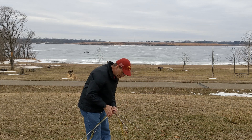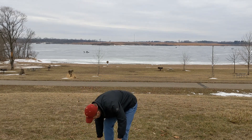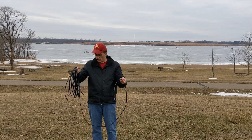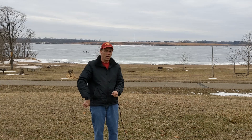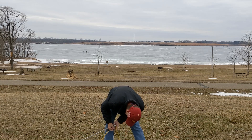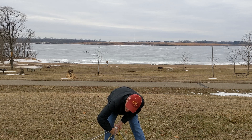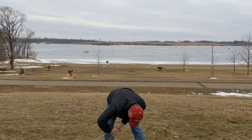Once I've got those guys in, I simply attach the coax to the base of that hub system. I typically use the over-under method of coiling up coax. The nice thing about that is when I'm done, I can just fling it toward where my radio is going to go — it uncoils, no tangles, and I'm ready to go. I've seen guys use a right-angle adapter there, or even a slip-on connector, but really this doesn't take too long.